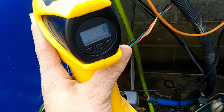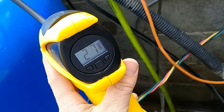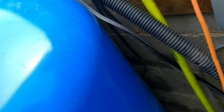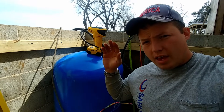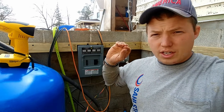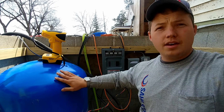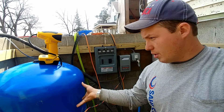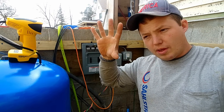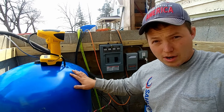It's crazy, it just stops so suddenly. We're at 27 psi and we should be at 28, so this thing is really close to perfect. Isn't that interesting — as soon as it hit that pressure that the tank is supposed to be set at, the water pressure dropped almost instantly. That's because we reached the full extent of the expansion of this tank. As soon as we hit that 27 psi it had fully depleted its expansion capability, and then the water pressure dropped right away because we had expelled all the water in the pressure tank.